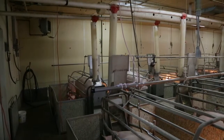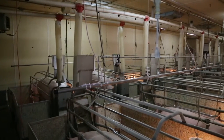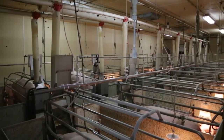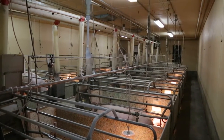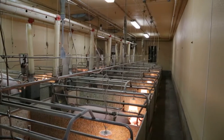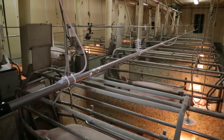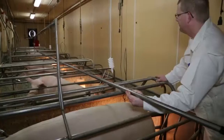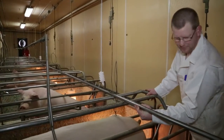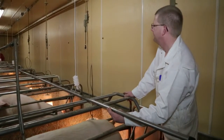Cut the pipe to length so the corona pipe runs the entire length of the pig space. Allow at least one foot of space between the end of the corona pipe run and the wall. Leave at least eight feet of space between the last pipe insulator and fans, such as at the end of a tunnel ventilated barn. Repeat these steps for each corona pipe run in a room. Put pipe caps on the end of each corona pipe run. Now center the corona pipe runs over the pig space. Take care not to damage the corona points welded to the pipe.